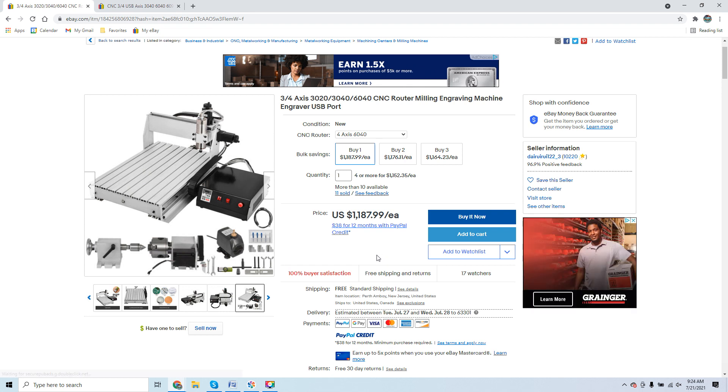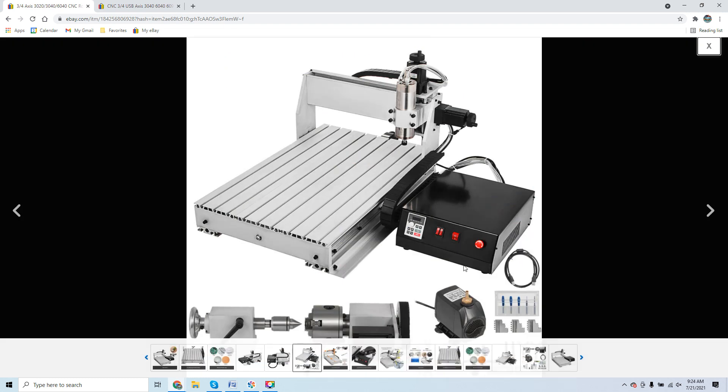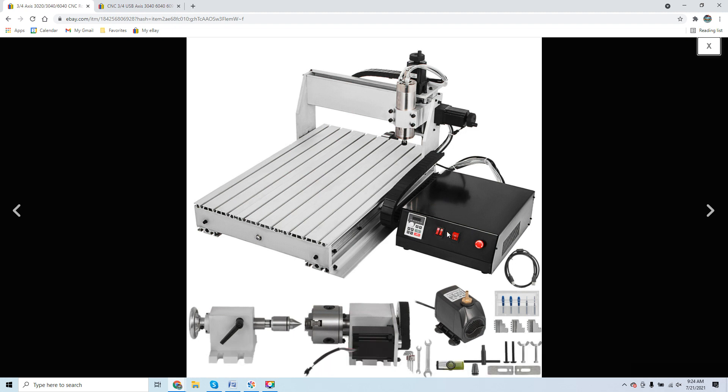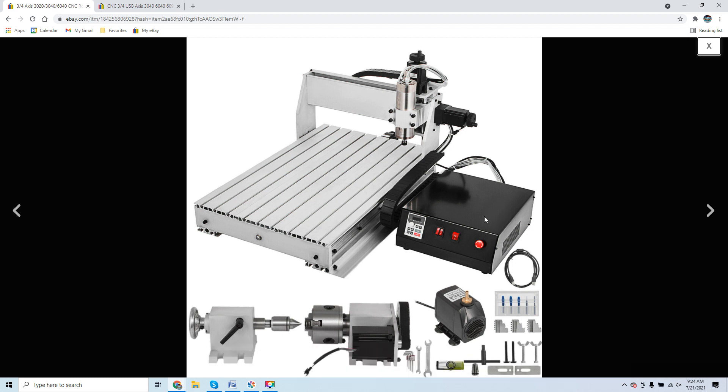We have to be realistic. At some point you'll want something better in terms of stability and controllability, and you'll look at doing a retrofit. None of the cables on these units are shielded. The Chinese have made their enclosures look clean — they put the VFD digital interface in with the VFD, which is a complete no-no. A metal enclosure surrounding the VFD acts as a Faraday cage, trapping EMI and surrounding all your electronics with interference. Step and direction signals are very low voltage and highly susceptible to EMI, making system accuracy hit-and-miss.